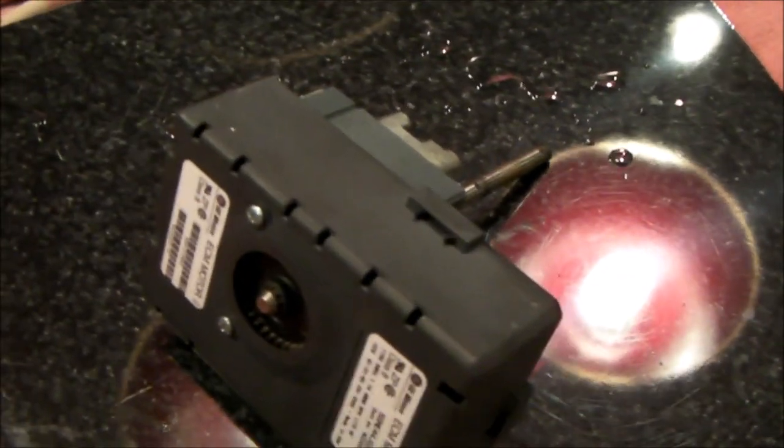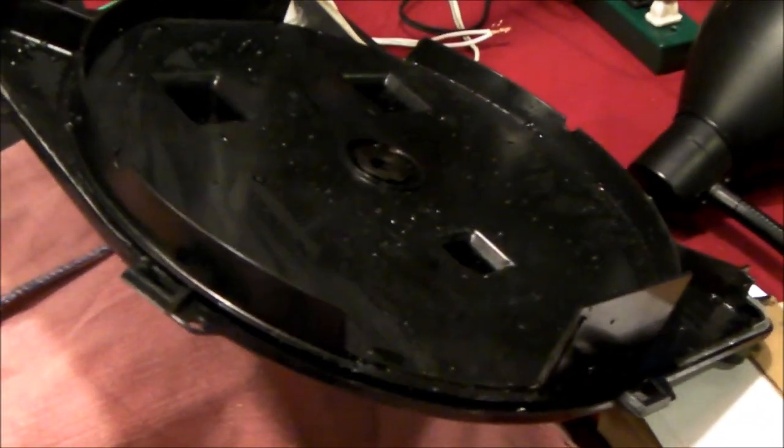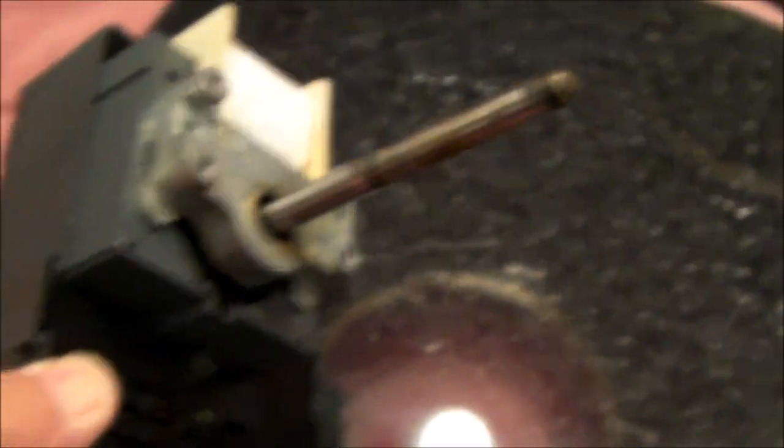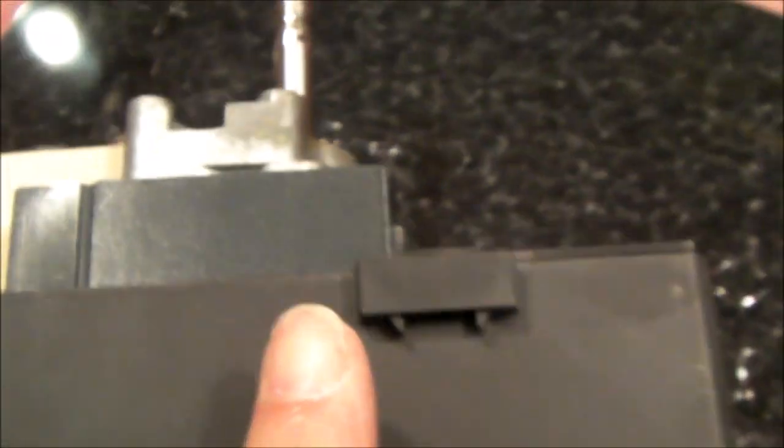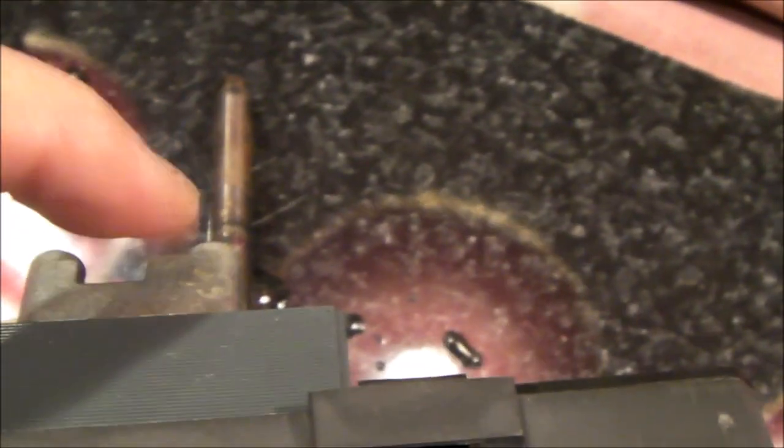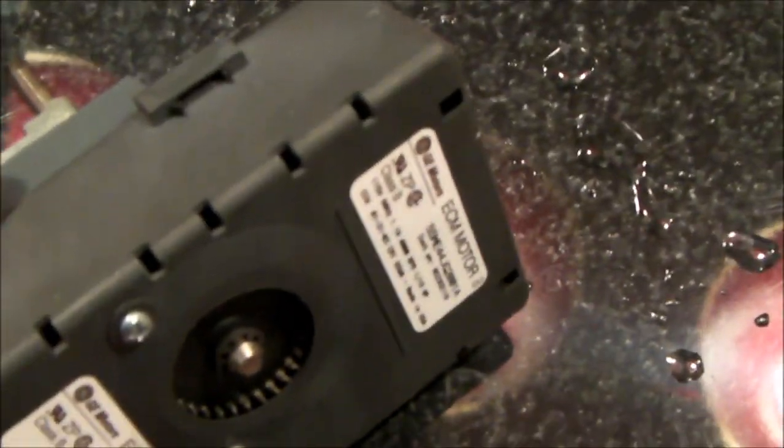You can see here I've got the motor completely out of the inducer. It's very straightforward, so I'm not going to waste video on how to do that — it's totally obvious. What's not obvious is how to get to this ball bearing right here. This bracket houses the bearing, but the screws come at it from the other side. The screws go in this way and pick up this bearing bracket, and the ball bearing is located inside here. So this cover needs to be removed, and this back cover is not going to come off easily without unsoldering the control board's electrical connections.